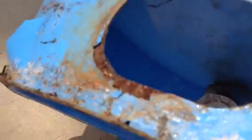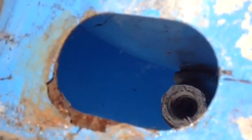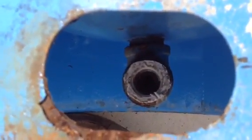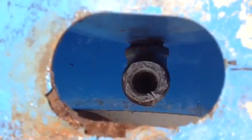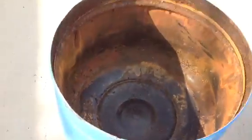That kind of defeated what I originally thought the problem was. However, when I took the tank apart I noticed something that really clued me in on the problem. Right there you can see the inlet pipe — a 90 degree pipe with a PVC to PVC adapter still on it, I couldn't get it off. But on the inside of that PVC, if you can see, it's completely clogged with rust and sediment, which is actually the reason for the tank's failure.